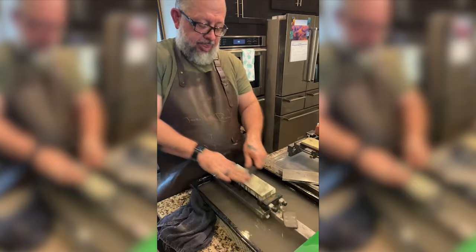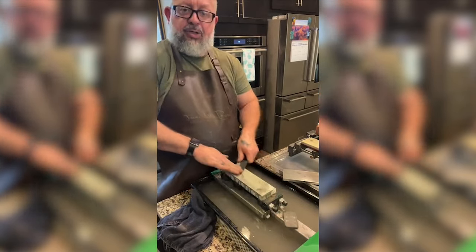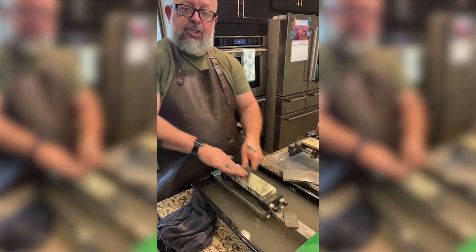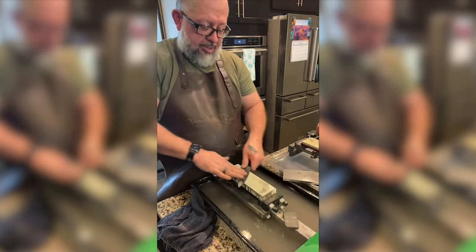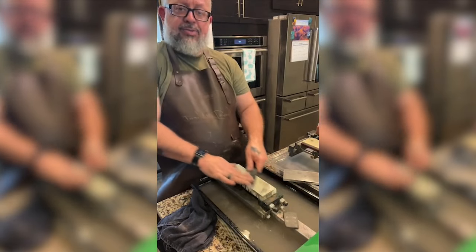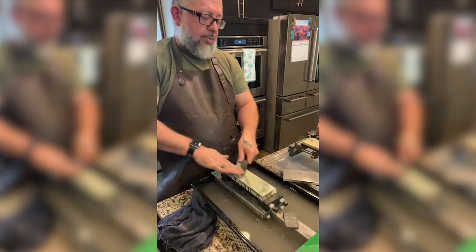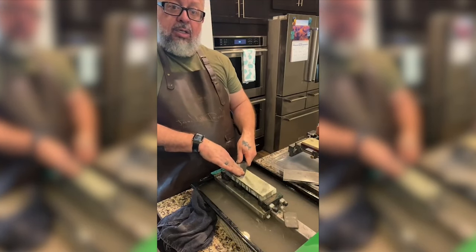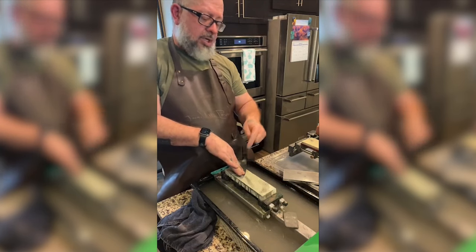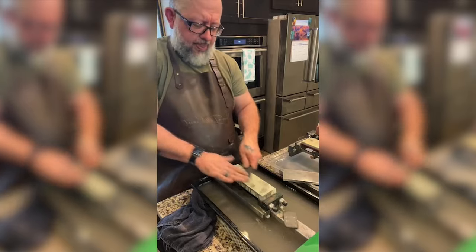Shout out. We're polishing a knife. We're on a Japanese natural stone right now. We started the knife, white number one, Shirogami number one. We started the knife on a 200, 300, 400, 1000, red Aoto, which is like a 2000. Now we're on the equivalent of something that's between 2 and 4000.